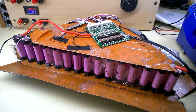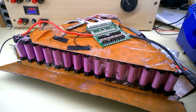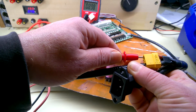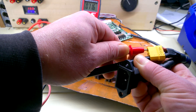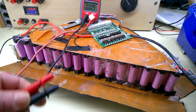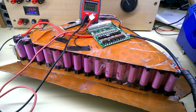I charged it up with the boost converter for about half an hour — both through the BMS and directly across the battery. I just checked and that bank that was at 2.8 volts has come up to about 3.3. So I reconnected the BMS and checked the voltage on the main power output — 71.7 volts! Compare that to 12 volts at the beginning. Bumping those cells up to 3.3 volts seems to have taken the protection offline, so this may indeed work.